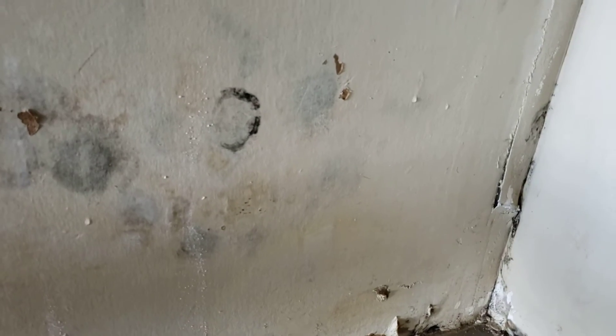If you've got some water on the sides of this stand, you can either dry it up and clean the mold off, or you can just pull that off. The stand should be in good shape. From what we were told, it just started leaking and they contained it. You can pull these off and put OSB board back on there, right out of Home Depot — it's 7/16ths oriented strand board, you don't need to buy plywood. Cap it off, and while it's open you can take a look inside. You can see you've got some fuzz growing right here, so that seems to indicate it's been leaking longer than just a little bit.